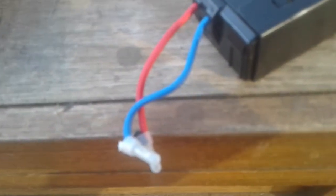My camera sucks. Anyways, it said right in there that this is a metal halide fixture, and that's why this base is so big, because it had to house this metal halide ballast. The red wire hooked to the black wire, the blue wire hooked to the white wire. That went over into here and up to the light fixture. So what I'm doing here is, basically because they burnt out the ballasts by putting in regular 75 watt par 30 halogen bulbs, I just bypassed the transformer completely and direct wired them.